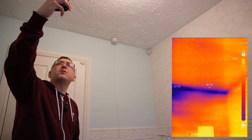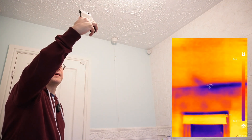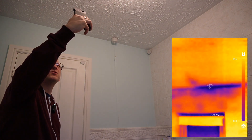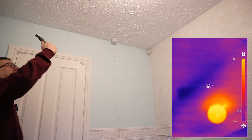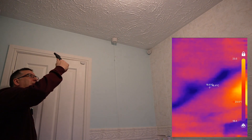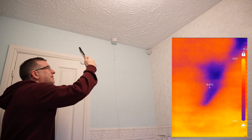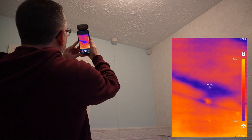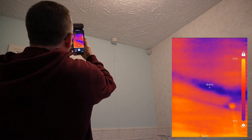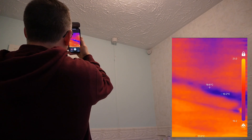In the bathroom there were three areas where I was going to try and improve the insulation. The first was along the ceiling against the outside wall — you can see it's slightly better than before. I think just there is where an A-frame comes down on the roof, so I'm not going to be able to do too much about that. Then there was a cold spot around here — you can see a beam running across the ceiling, so I'm not going to be able to get that. I put double insulation over the top of it as well, so maybe that'll improve over a few hours. And then up here, that's where the big tank frame was — it's better than before but I think there's still room for improvement. I'm really going to have to stuff insulation underneath all of the frame to improve on that.